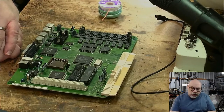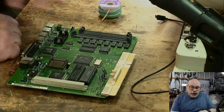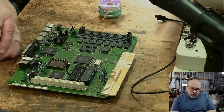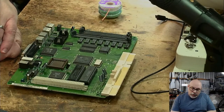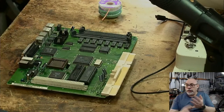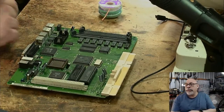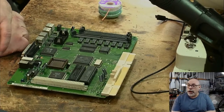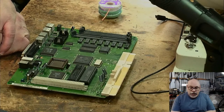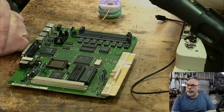And a lot of people don't even necessarily know of some of the larger suppliers out there that are going to be selling surface mount stuff. And more importantly, if you jump onto something like DigiKey, Mouser, or RS Components, and you search for a 47 microfarad 16 volt capacitor, you're likely to end up with like 1,000 results. For someone who's relatively new to this, that can be a little bit daunting. It's like, look at all these. Which one am I supposed to pick?